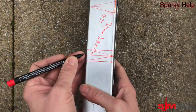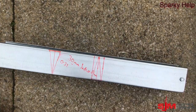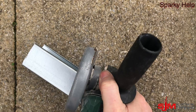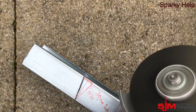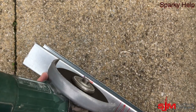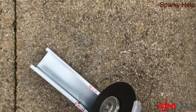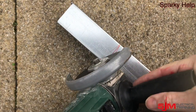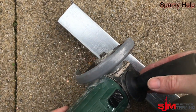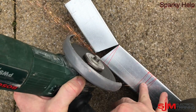I am going to mark out the bits — so this time we are going to take out those little tiny sections. Now why am I leaving those bits in? Because I need to be able to drill and they are slightly bigger, so I have 20mm to drill out to put fixings in. So being careful, you have to take that small bit out and try to go down at angles. When you cut, if you don't, you end up doing it square and you end up with a hole. Take out those sides — if you need to, bend the trunking out of the way.